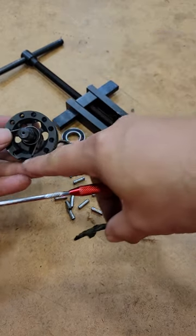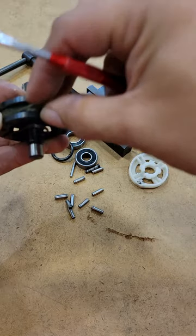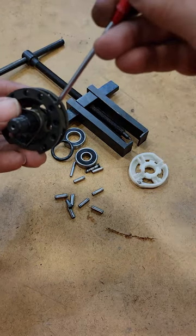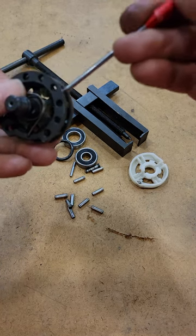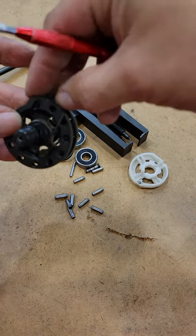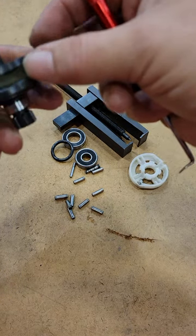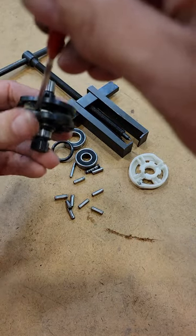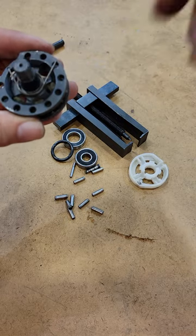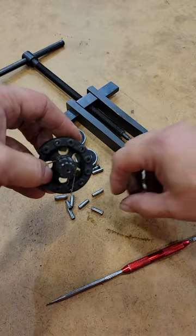We've got a new felt — we'll pretend this is a new felt. Look and see where the gap is and put the felt on so it goes down inside. There are openings in the middle of the pinwheel; the legs on the felt have to go into those openings — line it up and put it down in. We don't want it in front of the number one pin, so move it further away so the number one pin isn't interfered with. Press it down, check the inside — the felt is sticking through the holes, so we're good. Remember: one gram of grease in the felt, and a gram and a half evenly on the rest of the pins.